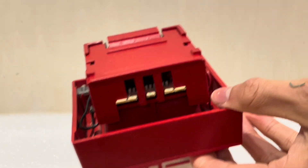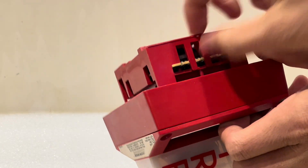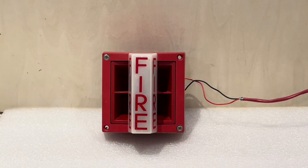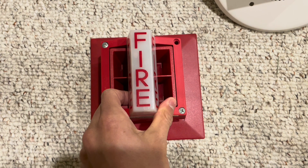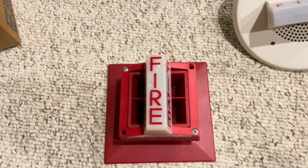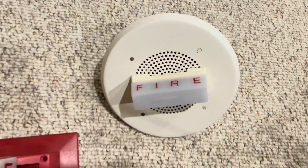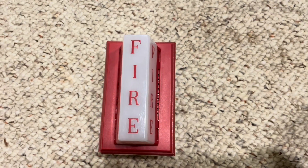On this side of the cover there are tabs on the older MASSes with the frosted strobe — to select the tone you'd have to break these tabs permanently with pliers, which was a little unfortunate. These units are commonly found on trim plates, making them look more flush with the wall. They also came in speaker strobe versions, and some had thinner fire lettering — all part of the older MASS series.